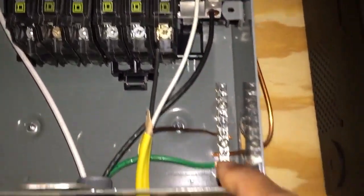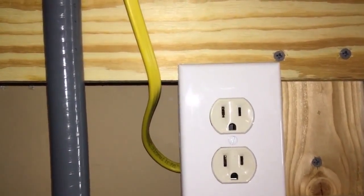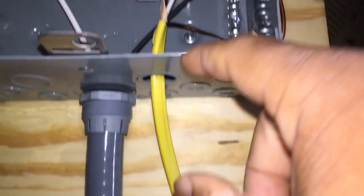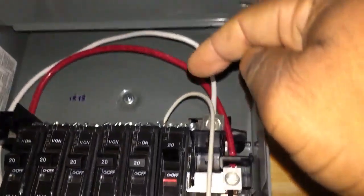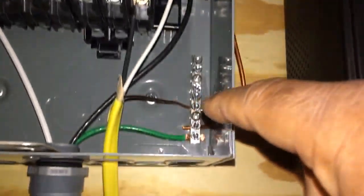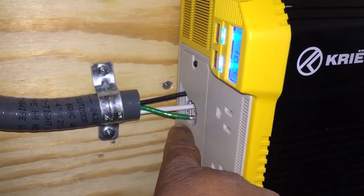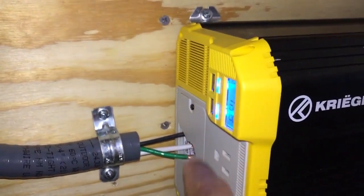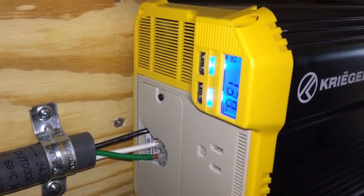Just to test and make sure my cables are right, I wanted to test an outlet. Got Romex, so the hot and neutral go into this breaker, neutral ties into the neutral bus bar — very straightforward. Got the grounding also, the ground lug running wire — so hot, neutral, ground. This is a hardwire connection.